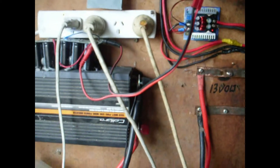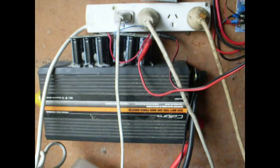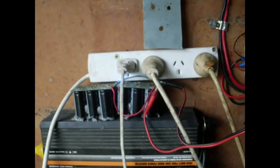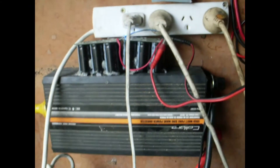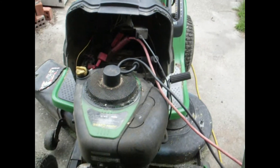It's running down to the 12 volt 1,000 watt inverter. I've got a capacitor pack there — that's to give it a little extra power when it starts the fridge motor, and that's taking about 500 watts or more. Here we have an old battery that's just being used as a capacitor because it really doesn't store any charge. And then there's the John Deere lawnmower battery.